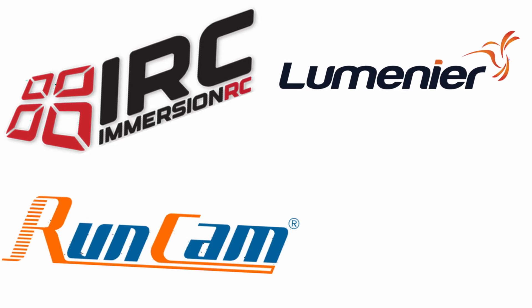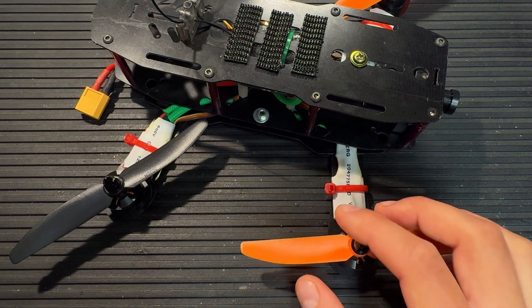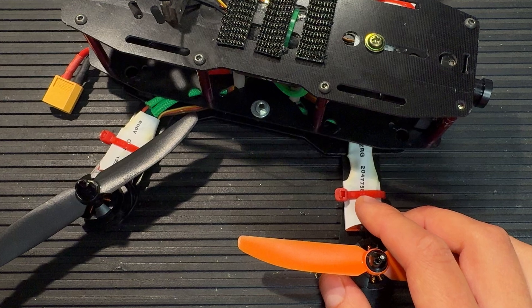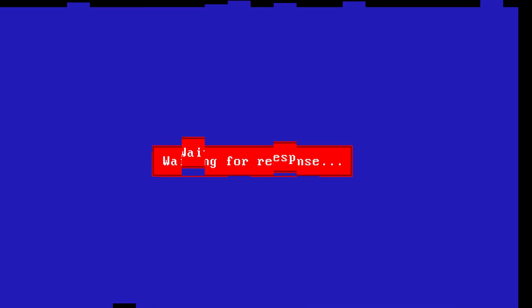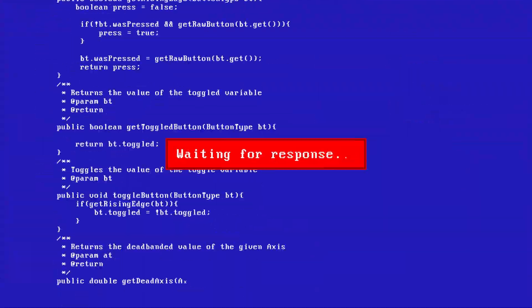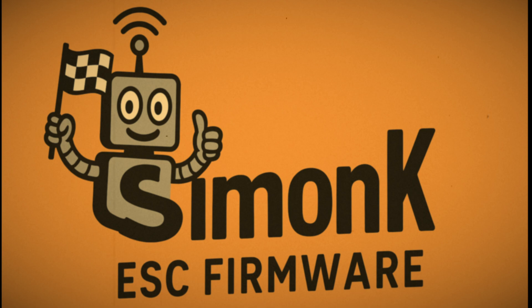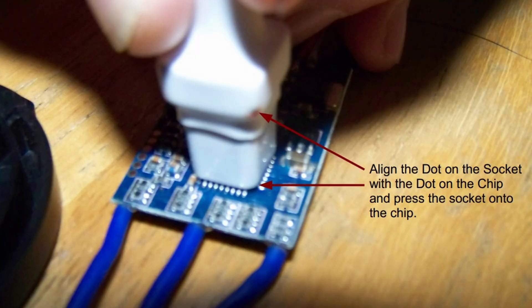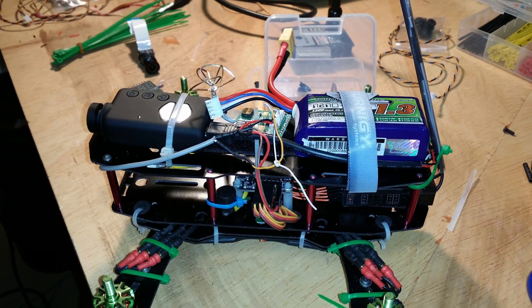In the beginning, most parts for these drone builds came from RC plane companies — they were really just starting to develop components specifically made for this type of FPV drone. For example, these ESCs were the same ones used in airplanes, but since drones require faster input processing and quicker response times, custom firmware was quickly developed. I remember flashing SimonK firmware onto these ESCs — you had to use special flashers and a custom flashing tool for the chip — everything was just a big hassle.